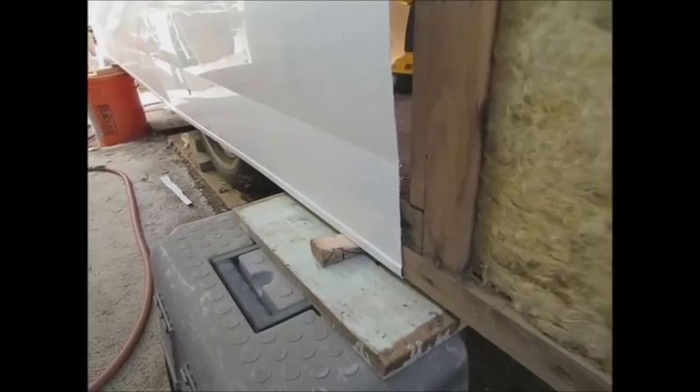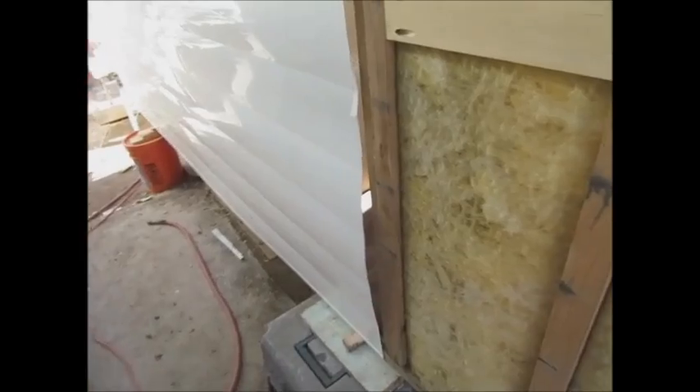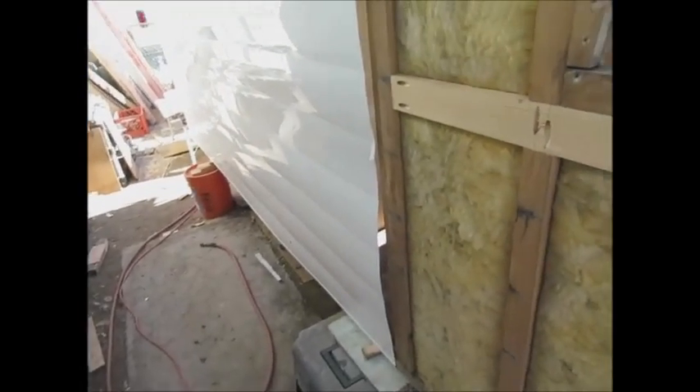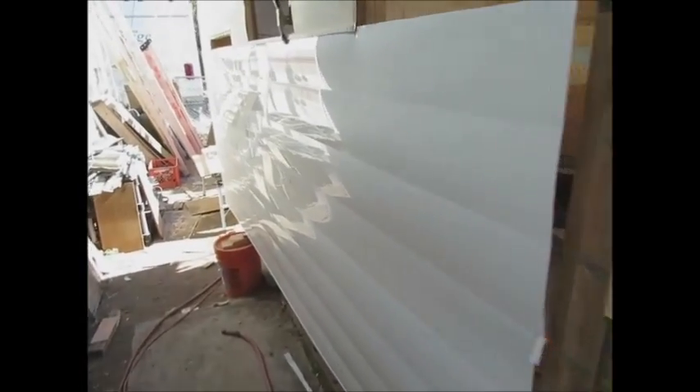You've got to cut this so that it slips into the Pittsburgh lock up here, or whatever type of seam lock you have. It also has to be tight at the bottom, and being that at the factory they didn't make anything square, plumb, straight, or level — how do you get the proper fit? That is Jody's question and that's what I'm going to attempt to show today. She's lucky that I screwed up my metal, because otherwise this would be done and I wouldn't have anything to show her.